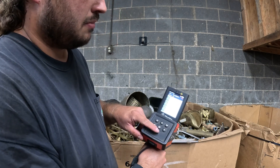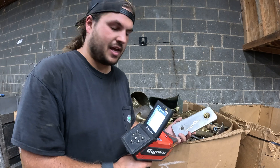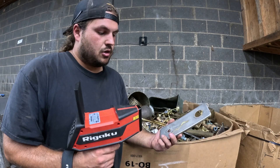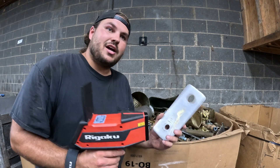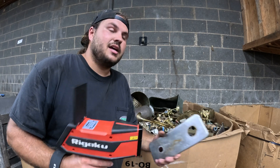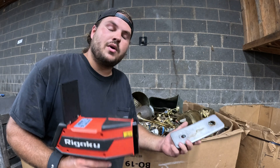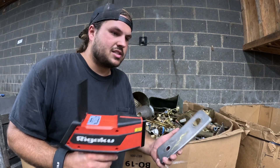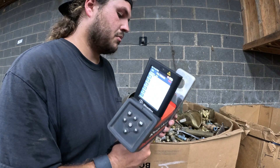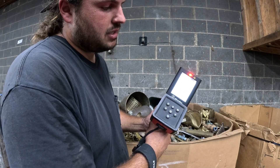We got no match, but it says 25% nickel and 65% chromium. If that were accurate, we'd have a pretty valuable nickel alloy — but we know that's not the case because when you scratch it, it is yellow underneath. I have seen people make this mistake. I've even had guys from here call me saying they're analyzing something and can't figure out how to price it because it was shooting as 100% tin. I asked them, did you grind the surface off and see if the material was consistent all the way through? The majority of the time it's not — it's just tin-plated or silver-plated. Now let's shoot the yellow part and see what it says there.